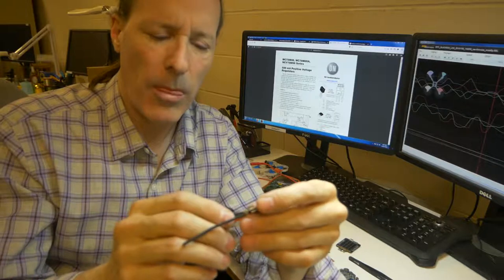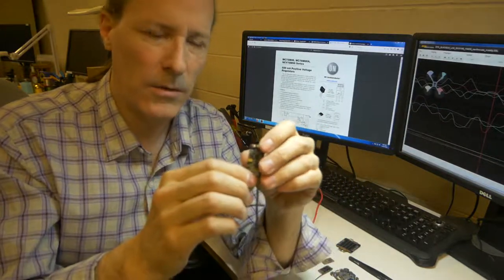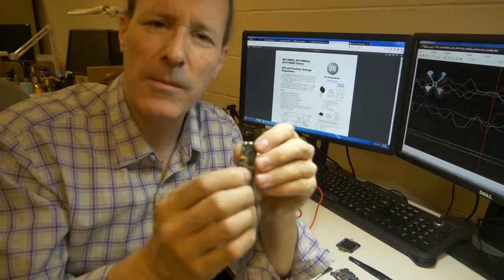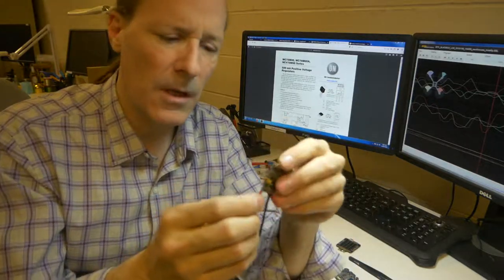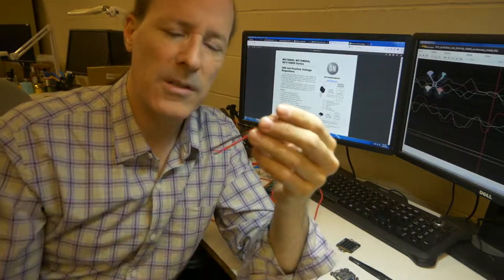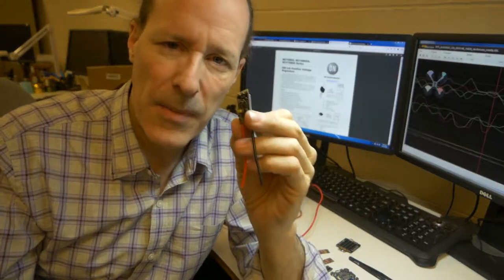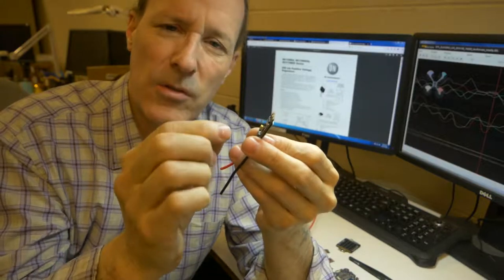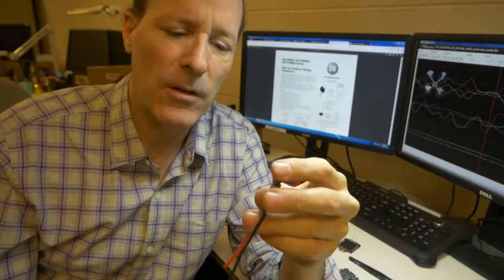So typically there'd be some solder mask, I'd scratch it off, and I could solder onto that and all would be fine. Except this thing doesn't have any ability to do that, because there's a bunch of other stuff around here, all these caps hiding right around there. And then there's a power wire on the back. So basically, if I'm going to scratch some solder mask off or tack onto the next component in line, I've got to figure out where it goes.